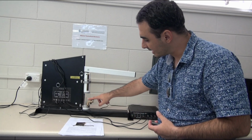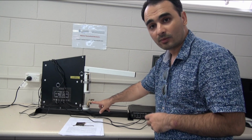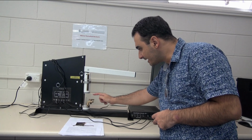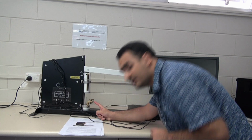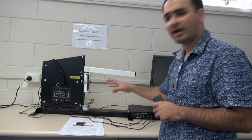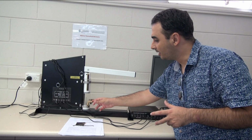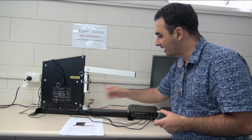If you focus inside the transparent cylinder, you can see we have two distinct sensors. One is a temperature sensor inside this green rectangular-shaped sensor, which consists of very fine nickel wires. If you try your best, you may be able to see those wires. Also, we have a pressure gauge or sensor inside this valve, which means we can read pressure and temperature inside this transparent cylinder for the gas we have.